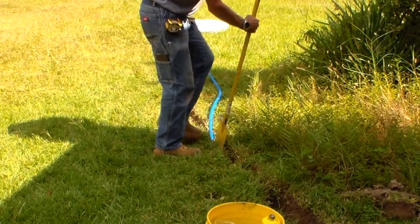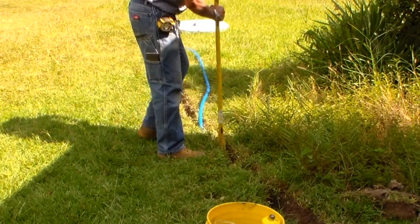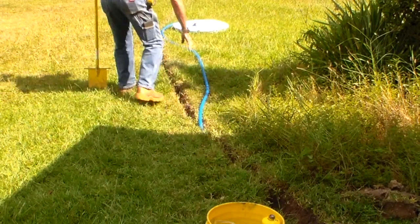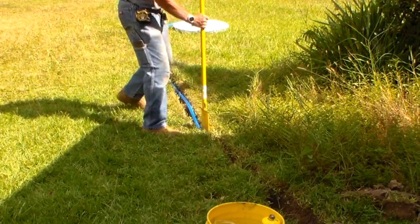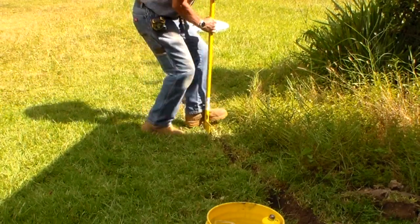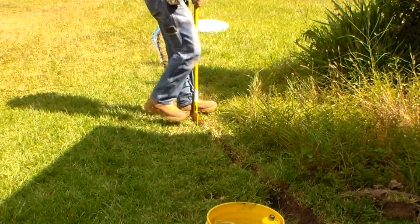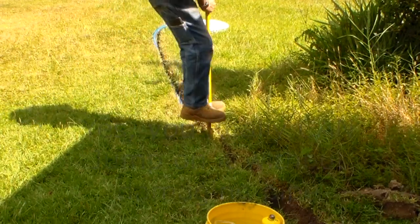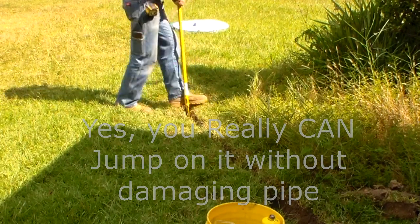Since I'm using an irrigation tool, I know that when the top of the tool blade is at ground level, the pipe or wire's top is now 8 inches below the ground. If I was using the electrical tool, the conduit would be 12 inches below the ground. I generally bury a few feet of pipe, then come back and cover up the trench. I have some roots in this area, so being able to jump up and down on the insertion tool helps me make sure that I have, in fact, buried the pipe as deep as needed.